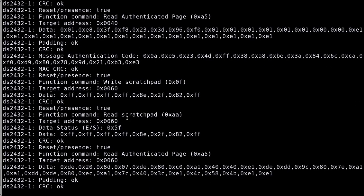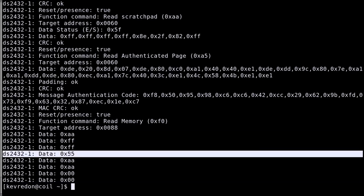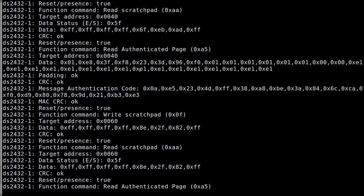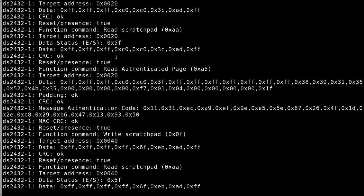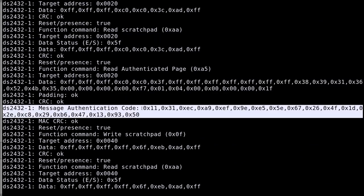And it seems to be secured because it even verifies if the secret is written, if the EEPROM is there. And the EEPROM data, so probably the toner level, which is at memory page 1, so this one, is authenticated. We've seen that you can only decrement it, but even for decrementing this value, you would need the secret. And that's the other important point.